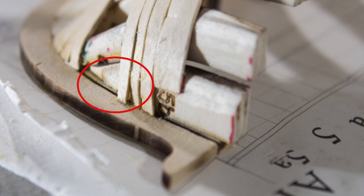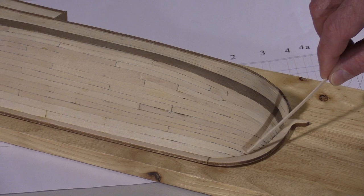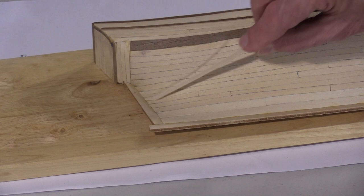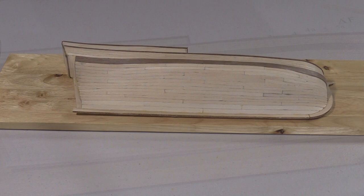Here's a photograph showing the channel before any planks are installed, and you can see how the planks are being installed one by one. Here's the finished product where the channel has been cut in and all the planks have been put in one by one. The channel actually goes all the way down the row — this is the garboard plank and it goes into a channel as well. At the stern it's the same thing; they all come down and meet, making a very nice smooth transition all the way along. This is really going to improve my future boat builds — it's been a very good lesson learned.